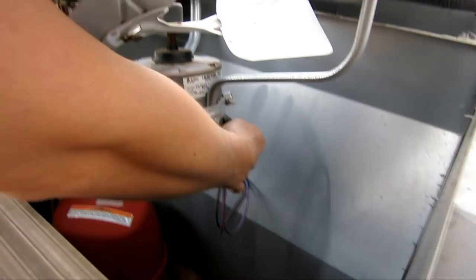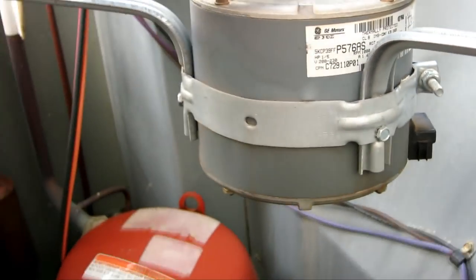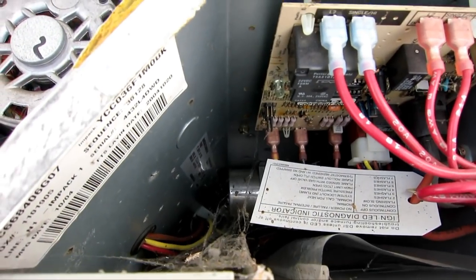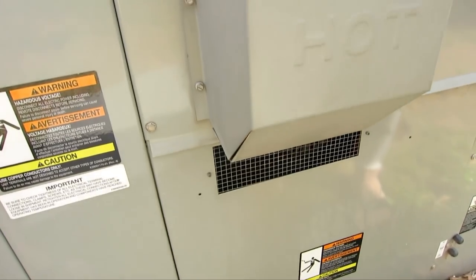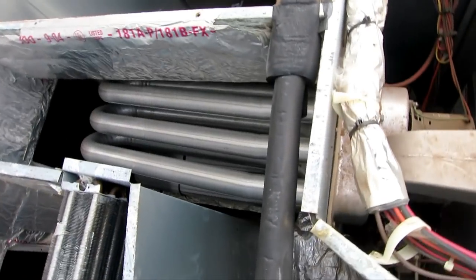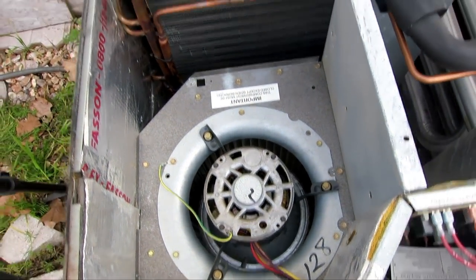As we lift this up, there's the fan right here. The circuit board is right here, and the run-start capacitor is down there. The heating unit, where it takes the natural gas and heats up your air, goes through here and the exhaust is right here. The condensing coil is right there, and that's your compressor. Right here is the furnace — those tubes are the furnace right there. The blower is right there, and the evaporator coil is right there. The air intake comes from here, and you can see the bugs and everything — so we're going to clean this.